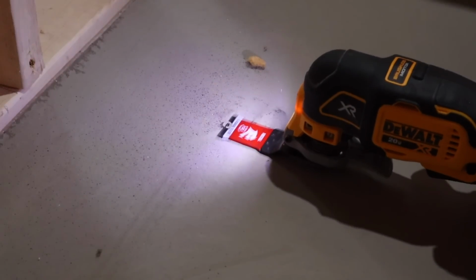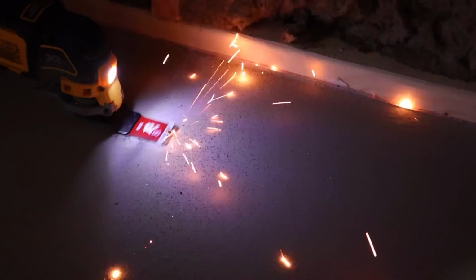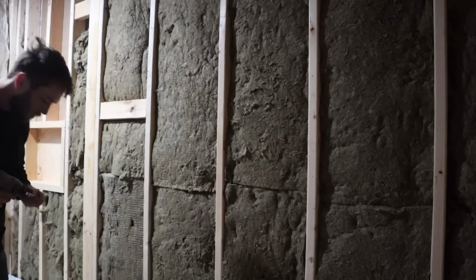We didn't quite fill it up just to the screw lines, so he had to take a multi-tool with a special bit to take off all the screw heads that were sticking above the concrete, but this worked beautifully for leveling our floors and was pretty straightforward and beginner friendly.